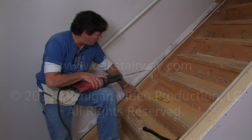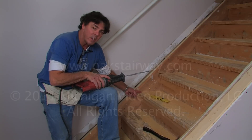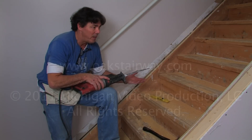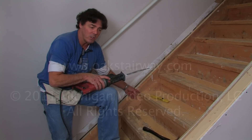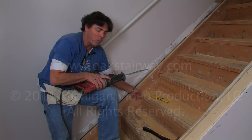I'd draw your attention to the area right here — there's a chance when you cut across in this area that there might be a nail, so just be on the lookout for that as you're cutting. That's where the reciprocating saw works out really well, because it'll cut the nail and the wood and cut it flush. We've got to cut it in this direction and this direction to free up this board on both sides of the track.